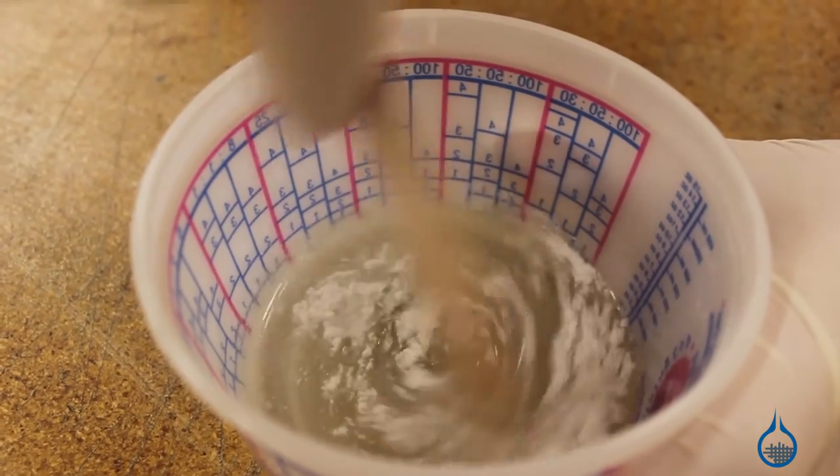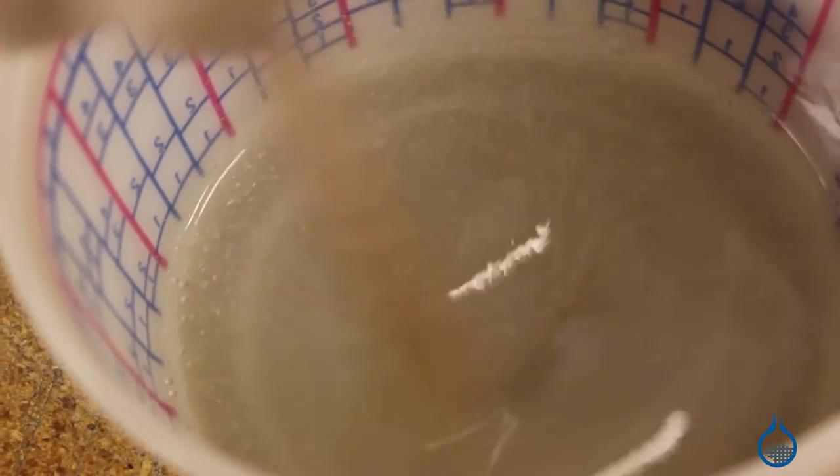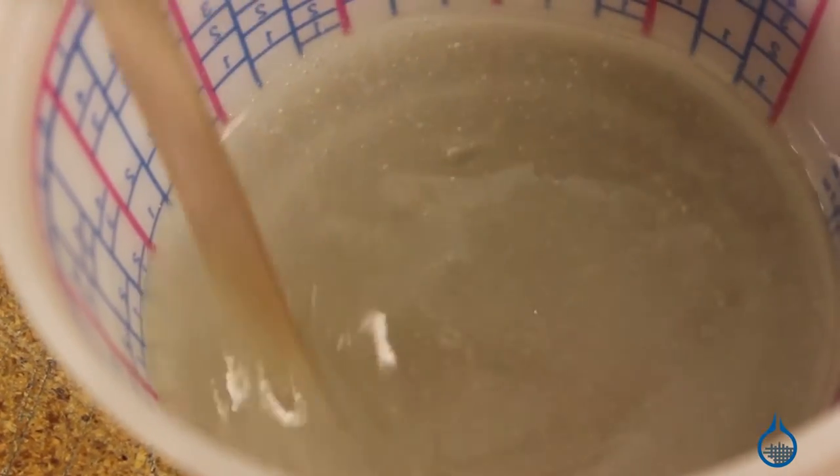These short fibers are added to resin 5% by weight after it's been catalyzed. Milled glass also helps reduce shrinkage and increase modulus for parts, which makes it popular for electrical and automotive components.